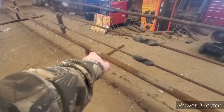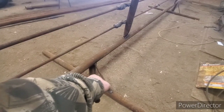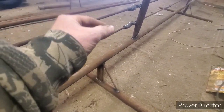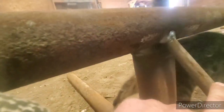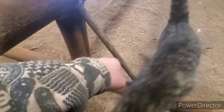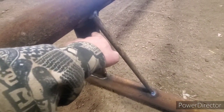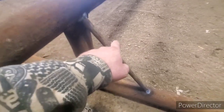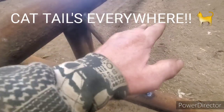I started squishing the feet and the reason why I did that is because it's less plasma cutting, less consumables, less smoke in the shop, and it's a lot quicker. I usually cut about one foot measurement and then squish it one way, then squish the other end the opposite way, so the bottom goes along the bottom and the top goes underneath the same way. Ashley went and took the tractor and bunted one — it was a saddle cut and it busted the foot off, but we welded it back on. I put 15-inch sucker rods on here now to help hold that foot and it's on the opposite side of the working side.